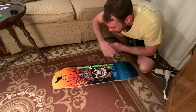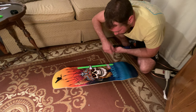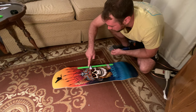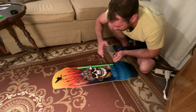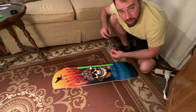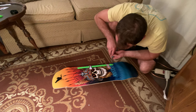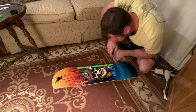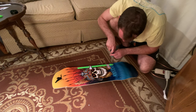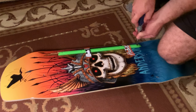Also, don't do the middle one first. Do the bottom one first or the top one first. I'm going to do the bottom one first, work my way down to the next screw, then the middle one, then on down. If you start from the middle and go to the ends, it can bow the rail. This is the most secure way to do it. So make sure it's lined up one last time — this is the last time I can look at it. The first screw is very important. Kind of hold the board with your knee and start screwing that baby in.